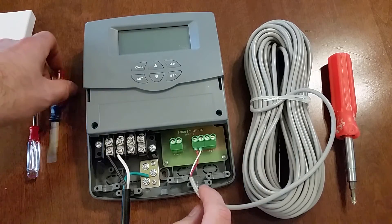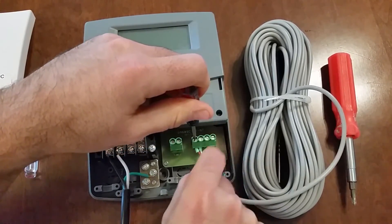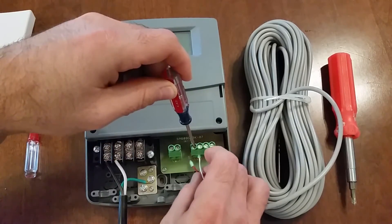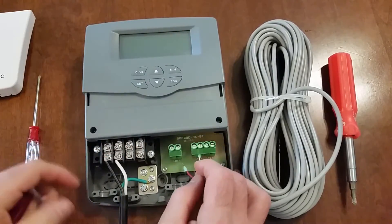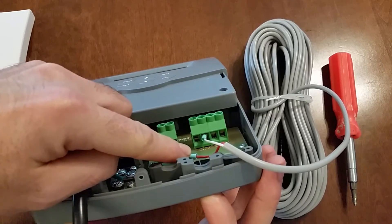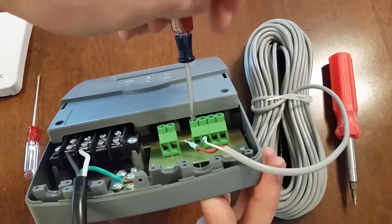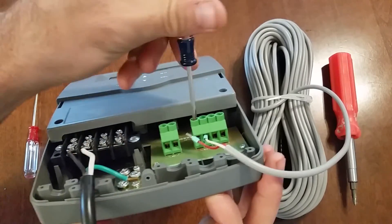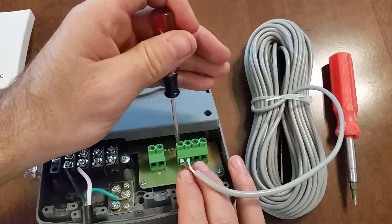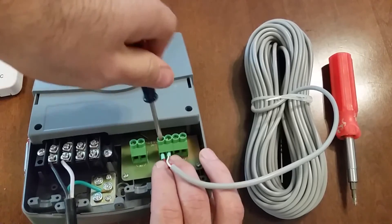This one's hooked up to T1. To put these wires in, you screw this counterclockwise to loosen and then you can pull this lead out. The temperature sensor cannot be wired backwards — it does not have a polarity, so you can't mess that up, fortunately. When you bring that down, the clamp is coming down from the top, and when you tighten it up it goes back up. When you're getting those wires in there, make sure you loosen it first, put the lead on top of the clamp, and then just tighten it back up. Make sure it's nice and tight — you can do the old pull test to make sure it's going to stay in there. Pulling on those and they're both in there pretty firmly, so that's good.